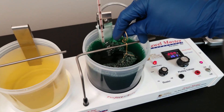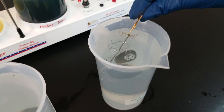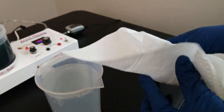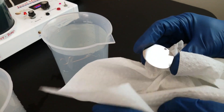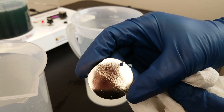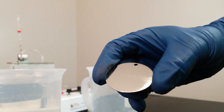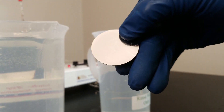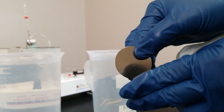So it's been about 15 minutes by now. We're just going to check it out and show you what we got. We could keep going — you could nickel plate for hours, but this should get you the point. Let me dry it off real fast. So although the scratches remain, it is extremely shiny now — you can see the reflection in it. I bet if you left it in there long enough, those scratches would eventually go away; they're probably not deep enough. The back didn't get as shiny, but it shined up. So if you were going to leave it in there for a prolonged period, you'd want to do half facing one way and then half facing the other.